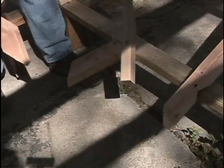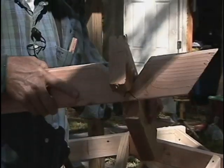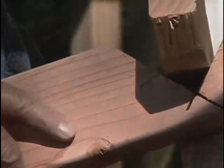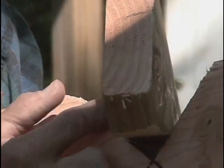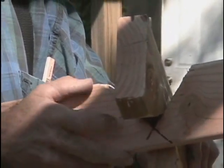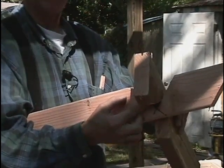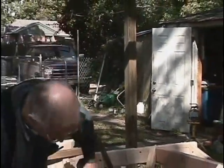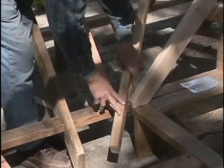The problem you get into is this little area where the jack is fitting in that corner. As we turn this up, you'll see that gap — that space that we have. We have to make up that space. Rather than trying to cut two 45-degree angles on the edge of your jack rafter, which is really difficult, what you want to do is just cut this thing back about an inch, so you're imitating moving this end to take up that space. In other words, you'll have about a one-inch space left — this is going to be one inch short.